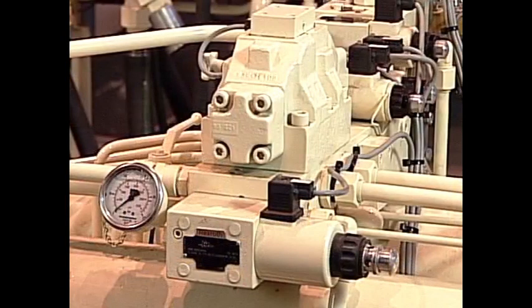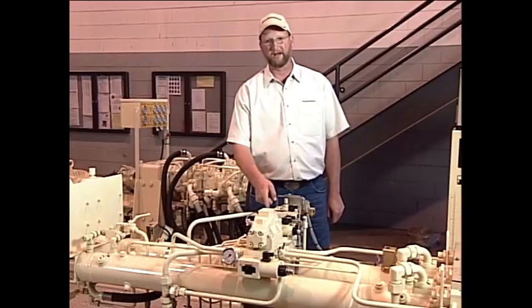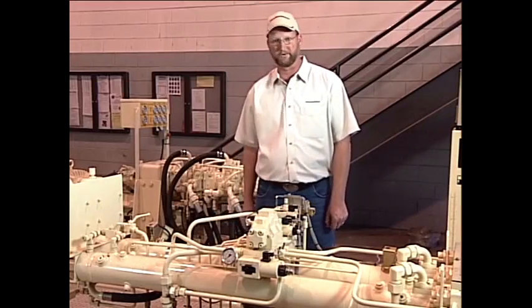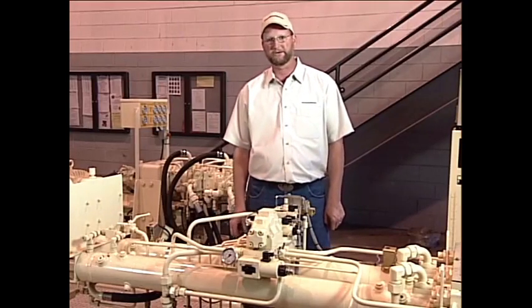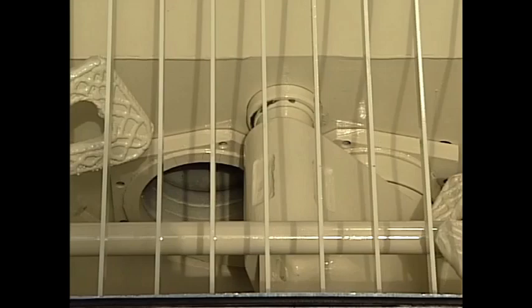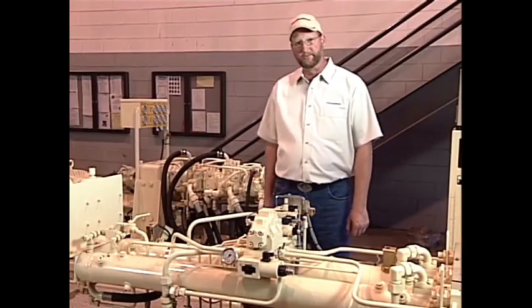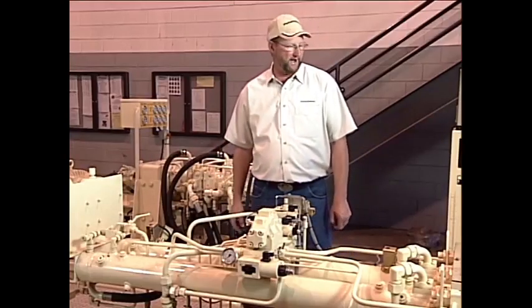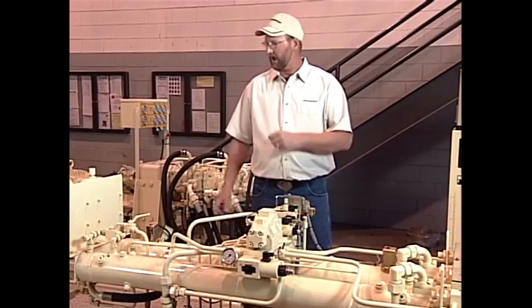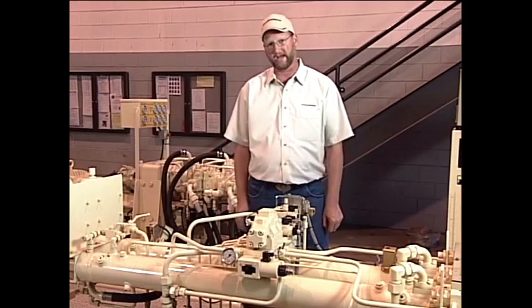While we're stroking, we're changing the S-tube from side to side. That's done with this S-tube valve. There are no electrical plug-ins on this valve. When we turn our cycle valve on, it sends a hydraulic signal into the cycle valve for the S-tube. This times perfectly our drive cylinder stroke change and our S-tube change. The S-tube is pressured by our accumulator pump, which stores high pressure energy to quickly change our S-tube.